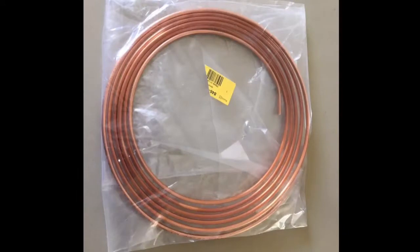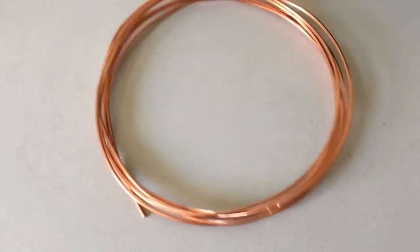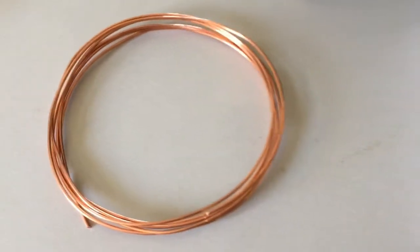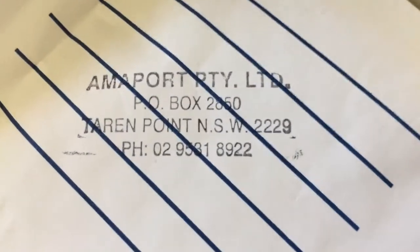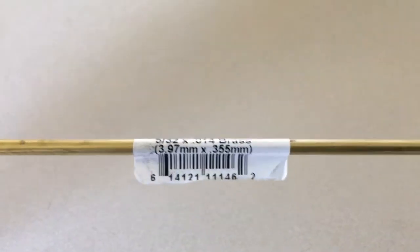I was originally planning to make the lobes out of 4mm copper tube left over from my Tesla coil primary, but after my first bend it became clear that wasn't going to happen, so I've gone to 2mm solid wire from eBay. I sourced brass tube from a local hobby shop and just selected the gauge based on the gauge of the coax.